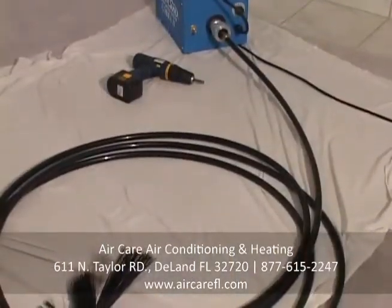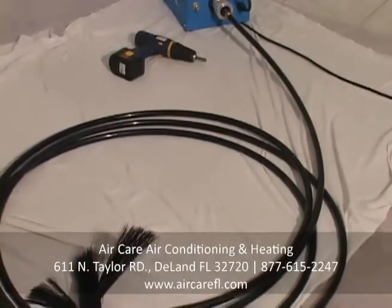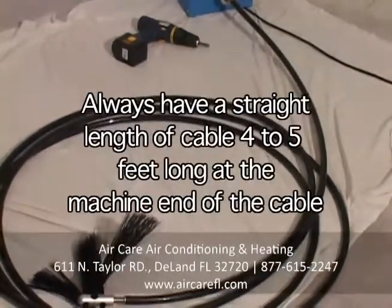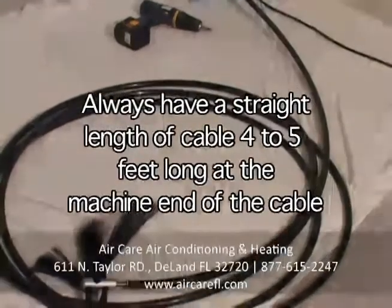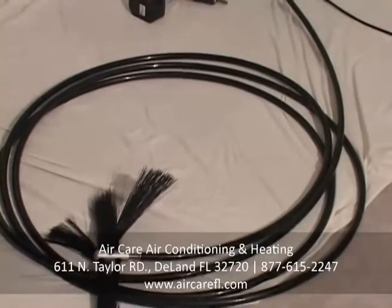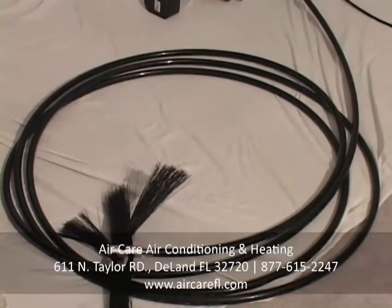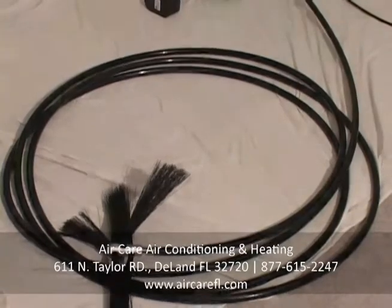A small degree of caution will yield many years of service from the Cobra. Always have a straight length of cable, 4 to 5 feet long at the machine end of the cable. This will prevent the cable from causing friction on the inside of the cable housing and melting through the housing.